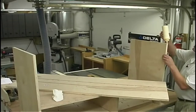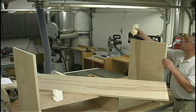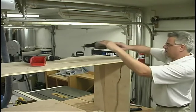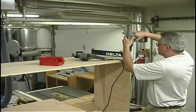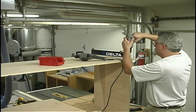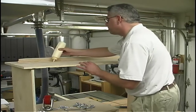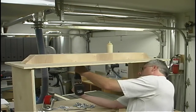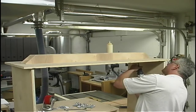And now we can get ready to put the bottom on. Again, this is upside down and you're looking at it through the back side. We can drive in some 1¼ inch wood screws to hold the bottom onto the inner side panels. Now we can install the bottom braces. I've already gone through, pre-drilled and countersunk the holes for the mounting screws, of which we'll be using 1½ inch long wood screws. And I'll space them out about 10 inches apart.